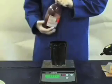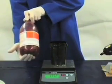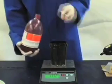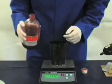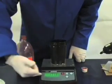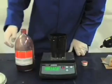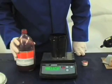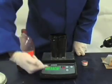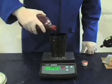So now we need to work out what our 5% is — the 5% catalyst that we're going to put in. A pigment has been previously added to it so you can make sure that it's mixed fully. As soon as it's a consistent pink colour you know that the catalyst is mixed in thoroughly. We just move the decimal point along to the left once and that will give us our 10%, then we can just half that figure and we know that that is 5%.